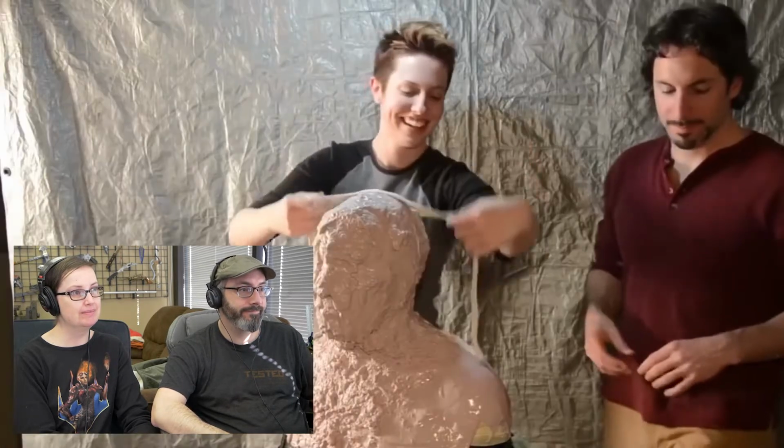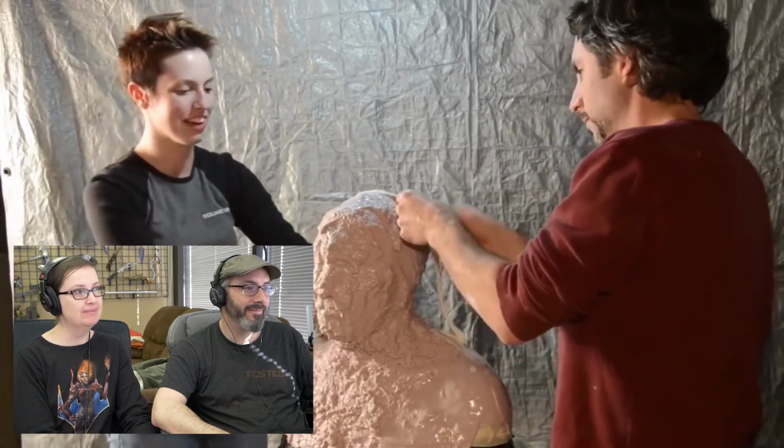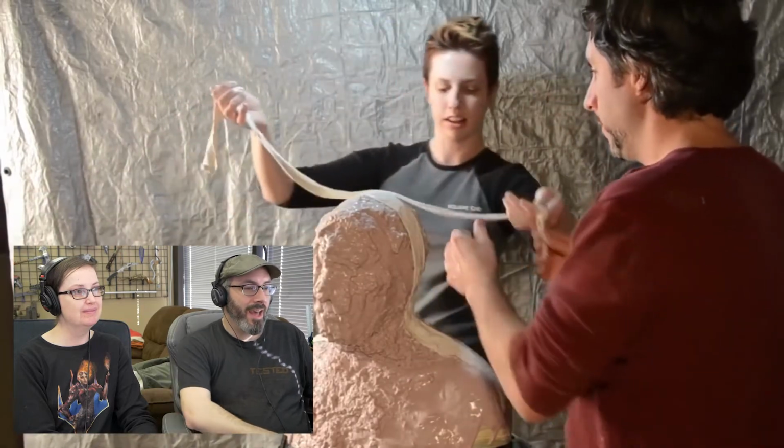With all of the funny business out of the way, you can start on the rigid mother mold. We ended up doing the back of the mother mold first, but I would recommend going with the front of it first. Start by putting a really nice, thick seam down the middle of the head from shoulder to shoulder. Later on, this will provide a registration point.